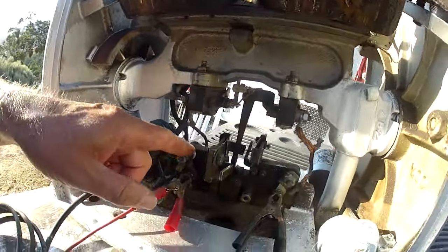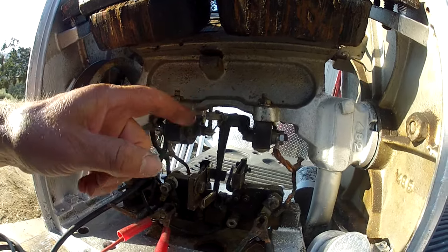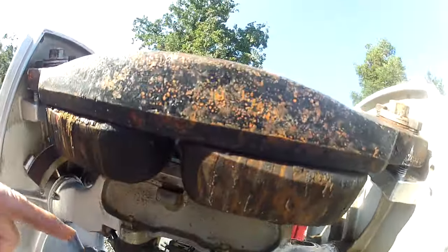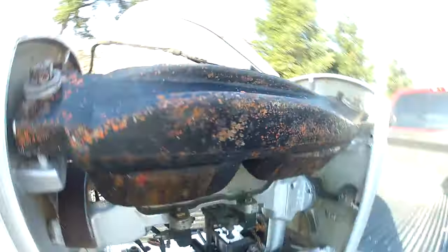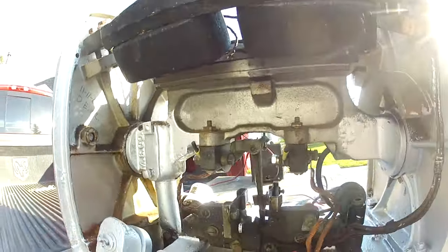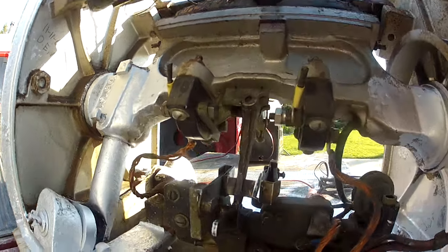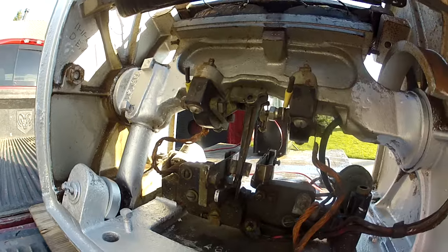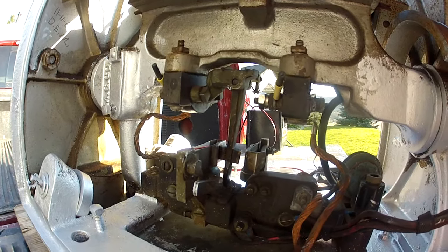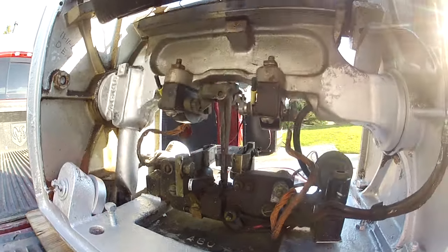The power goes up through here and into the swing arm. As this moves, it touches these contacts. When it hits the contact, it energizes the magnet — there's a magnet on this side and a magnet on this side. When the magnet gets energized, it pulls it in one direction. Then it loses power as the swing arm gets to center, and the weight of it makes it go the other way. It makes contact there, energizes the other magnet, and pulls it that way. So basically it just goes back and forth like this.